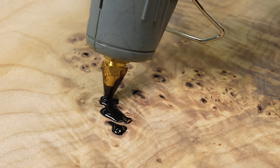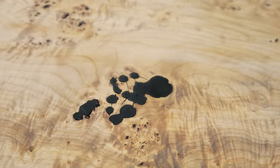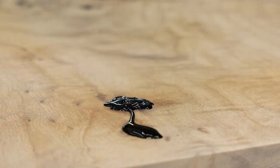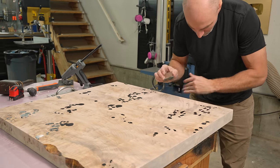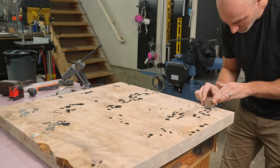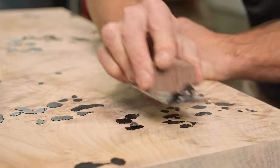These burl pits are one of the most frustrating things to try to fill. One of the only ways I've had luck with this is using a kind of black hot-glue substance. I don't love this with a wipe-down oil finish because it doesn't leave quite as smooth or hard a surface as something like epoxy, but it does a really good job at sealing up those holes and will enable me to have that film finish from the spray gun over the top of it.